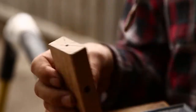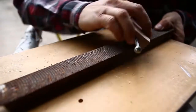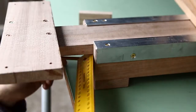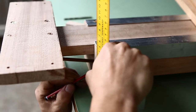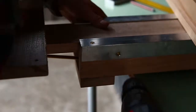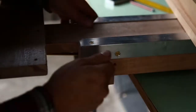Another mistake I made was not realising that the film is actually going to have to be behind the rear standard so that you can insert and remove a dark slide. What actually happened was I designed this to only just give me infinity focus, and then I calculated that with the film behind the rear standard I was never going to get infinity. More changes needed.